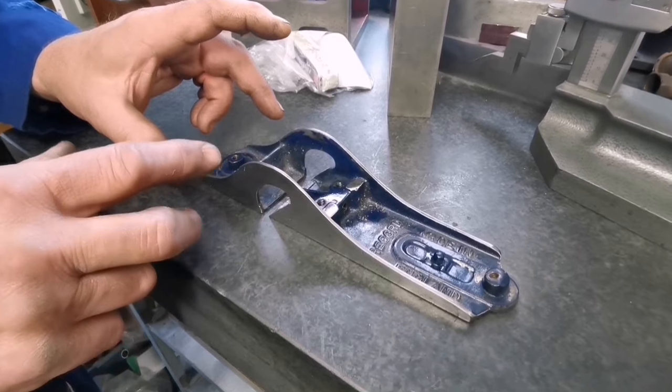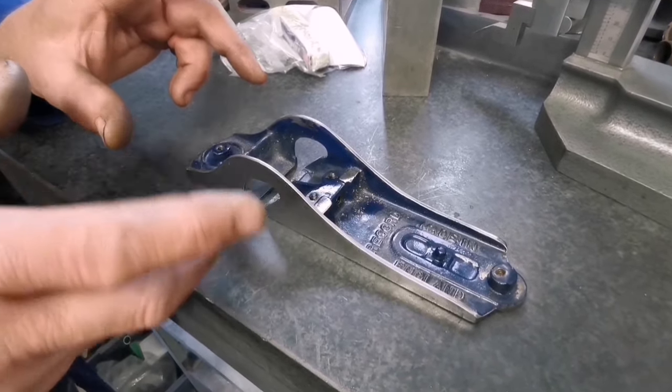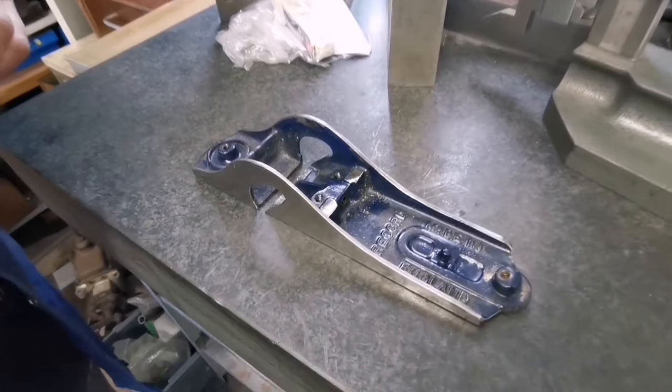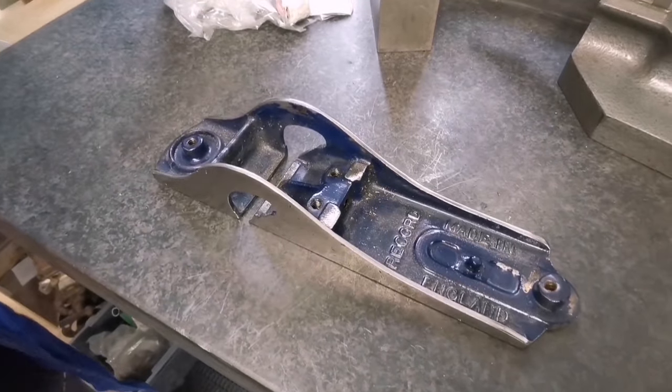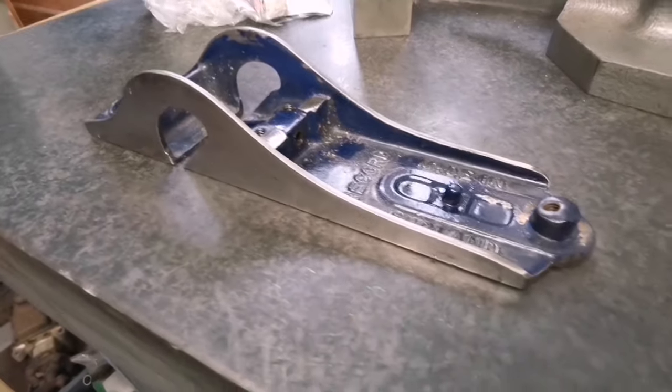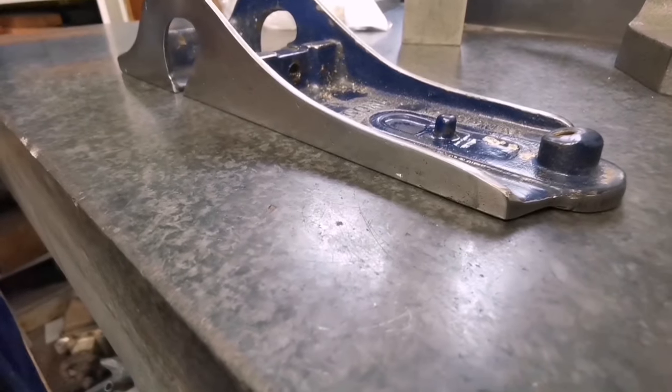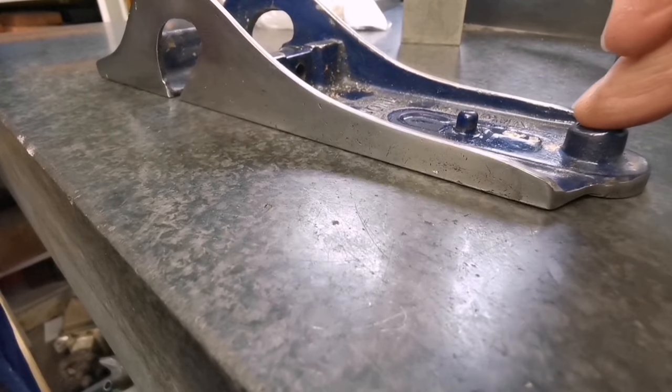because obviously the issue being with a casting, some people say you should pull them cold, some people will say you should pull them hot. The issue being is if there's any inherent tension in it, we'll know when we heat it, because unfortunately it will go ping and then become two pieces. But we do have a repair strategy.